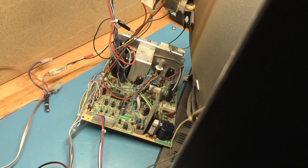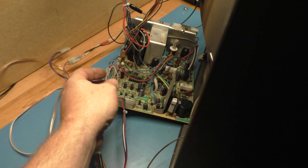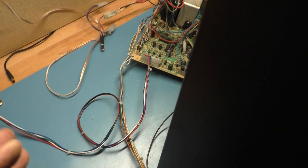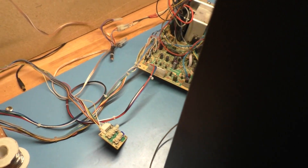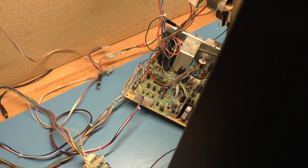Power and video are now hooked up. We've got anode, neck, yoke, ground, remote, power, and video — everything's ready. I'm using an MK1 PCB as opposed to a TPG so I can get a more accurate representation of width, size, and color. All the color pots are in center positions to get a good baseline on color and see how the tube is — whether it's tired or weak. Time to find out — one, two, three.